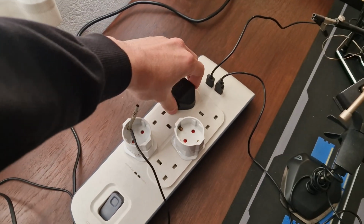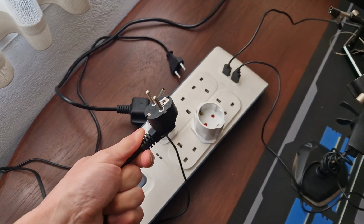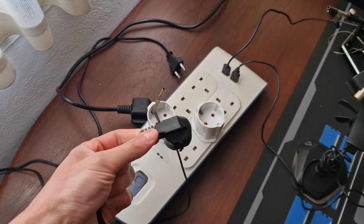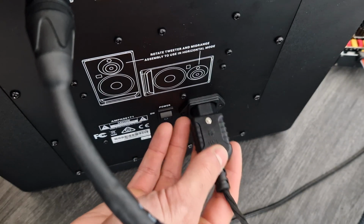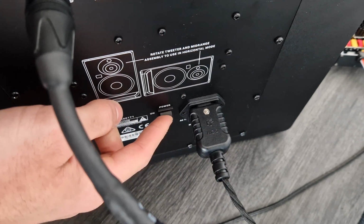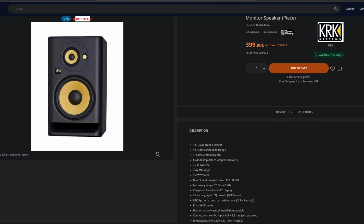I tried everything, from unplugging my speakers from my power strip and connecting them to a circuit with nothing else on it, to using them without a ground in an attempt to identify the cause of the issue. All of these tests were conducted with no signal from my DAC, so that the speaker was isolated from any external noise. Based on these tests, I can confirm that the issue lies within the speaker and not with any external factors. It's a shame that such a good value speaker, which only costs €800 per pair and has such great performance, also has this major flaw.